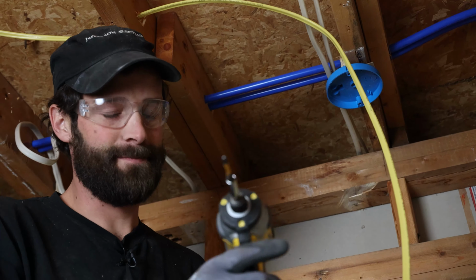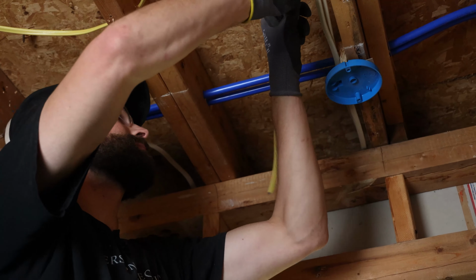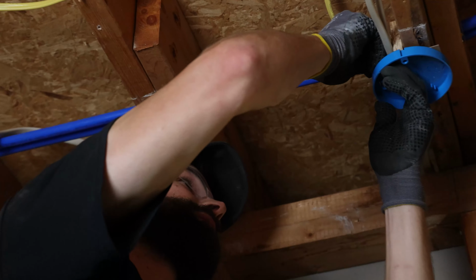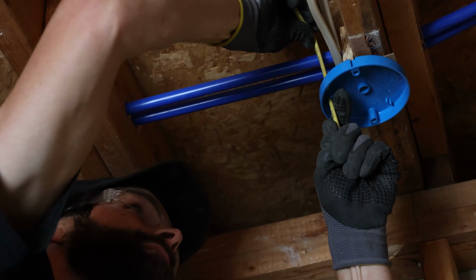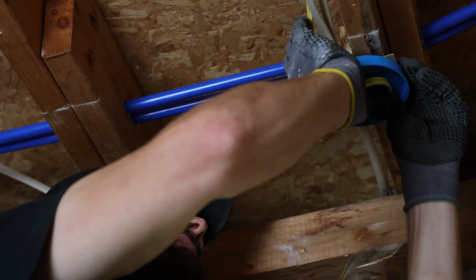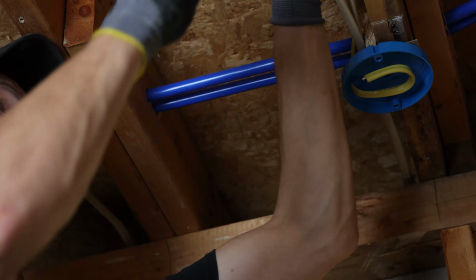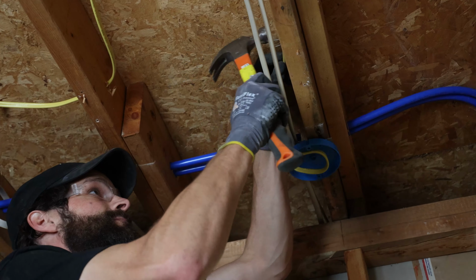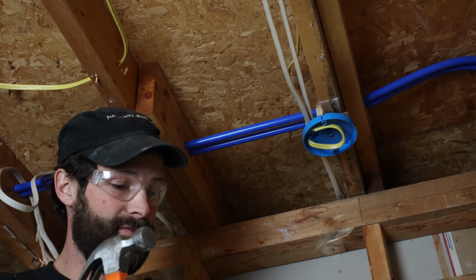That's it. All right. There it is, plenty of extra wire. Cable clamp, only one cable in the shallow fan box. That's plenty. We're gonna leave the jacket on it just to help protect it a little bit more from Roto-Zips and the likes thereof. I'm gonna leave a service loop in there, 12 inch max, because this little flap does count as a clamp from a code perspective.